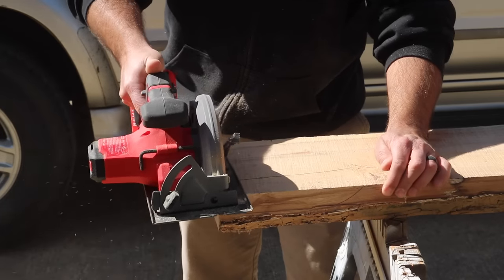I wanted a full, even depth of the bar top all the way down. With all the voids, if I hadn't poured the epoxy it would have looked funny. So this basically squares everything off and gives me a full 8 to 9 inches all the way down the entire length of the bar top. Here you can see some of the leaks — that's a hole on the top side of the slab, so the epoxy just seeped through.